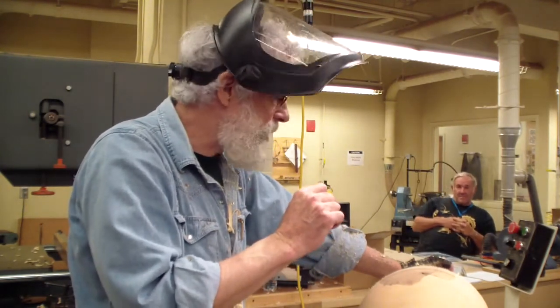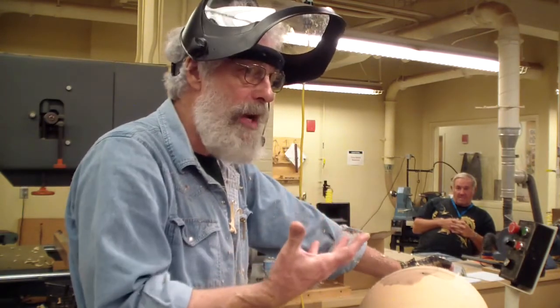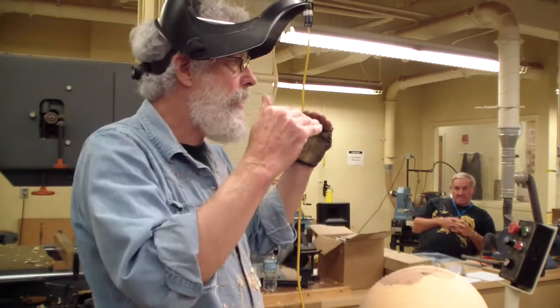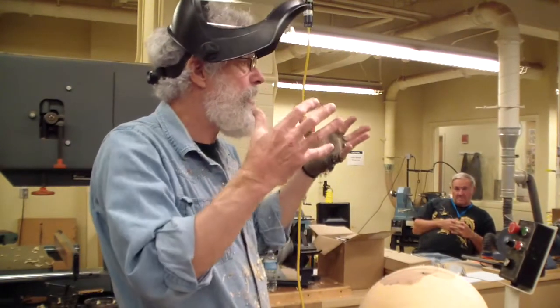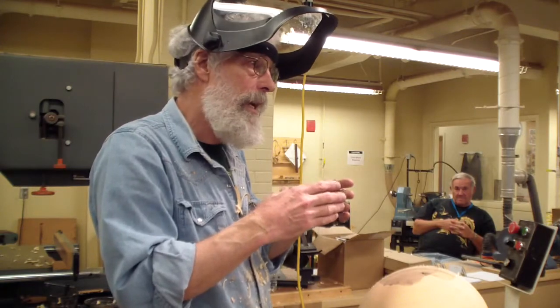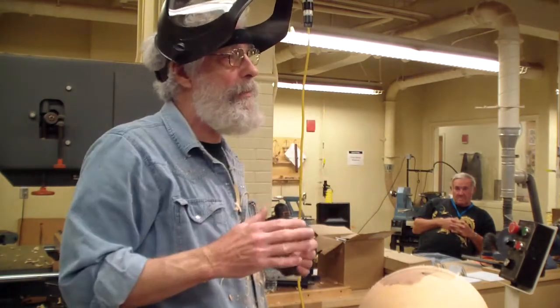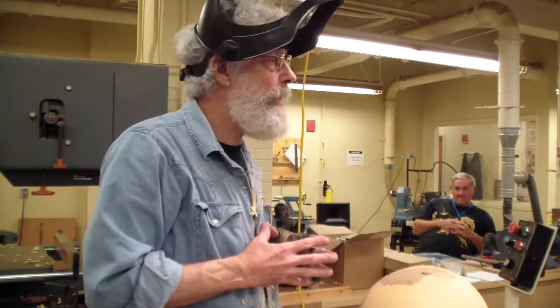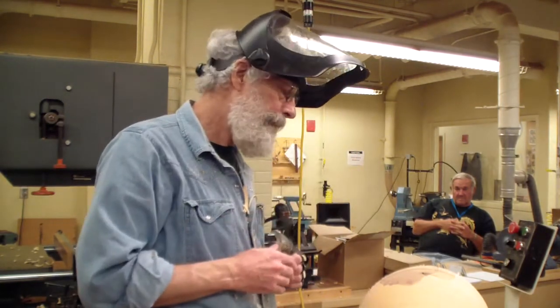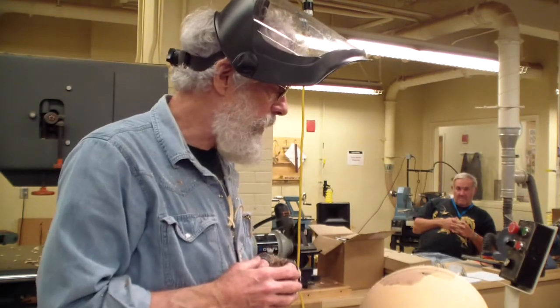But my point is that when I'm making small hollow forms with the pith going through it, I can arrange the location of that pith so it fills the shape after the object has distorted from the green to the dry. And in some cases, I've even put the pith going diagonally through the form to really give it a strange distortion when it's done. All sorts of ways one can play around with that.